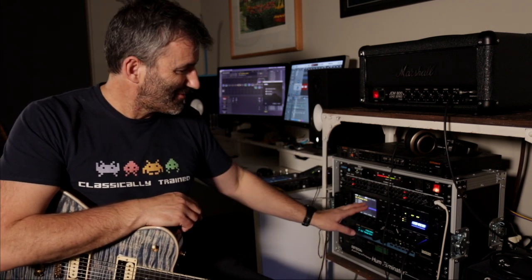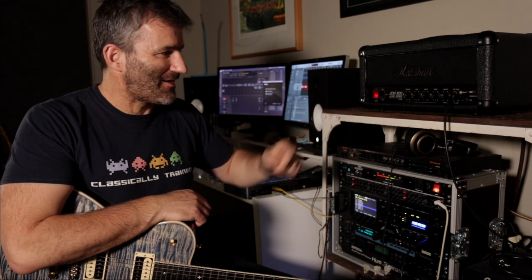Before I modded this thing, I actually recorded a riff into the looper on my Axe-Fx here, right? And I recorded the amp completely stock. I kept the loop saved in the Axe-Fx, like I didn't turn it off, kept it on for a few days, right? And I replayed and re-recorded that same loop through this amp with the S.I.R. 34 mod, the 34 with the Zener 1 mode, and the 34 with the Zener 2 mode. We'll do that now back to back, and to finish off the video, I will show you the changes that I've made, the schematic, and some detailed pictures of the mods themselves, just in case you were minded to warm up your soldering iron and make these changes to your Studio Classic 20.